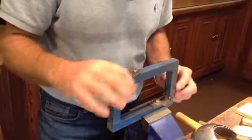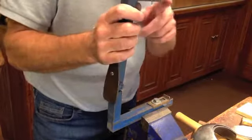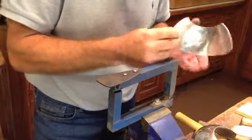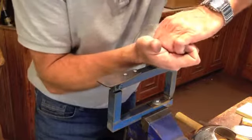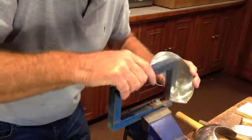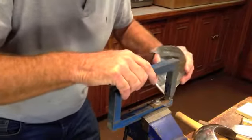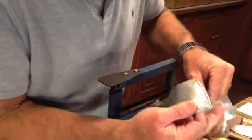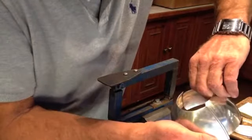This little tool here is called a swage. Basically you work it with your hand — it's got a little groove in it and a pointy end here. It'll push the silver down to form a little groove, forcing this end up here, and this will then make the little joint that we require. You can see what's happened with this one side — you've got this beautiful area here. I'll do the same with the other side, and then this section here is going to be folded back and it'll fit in there tight.